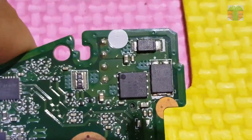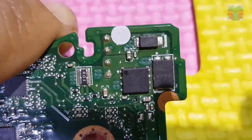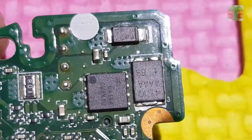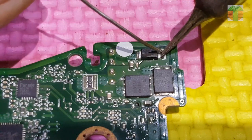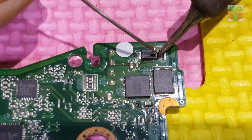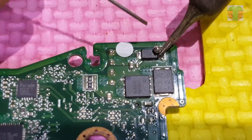This diode is shorted. It's always this diode that gets shorted. It's connected parallel to the main DC input. This diode might be a zener diode to prevent a high voltage or for reverse polarity. But it is not important to put this in the DC input. I have repaired a dozen that have this issue. Others don't put a diode across the DC line.